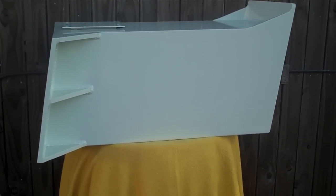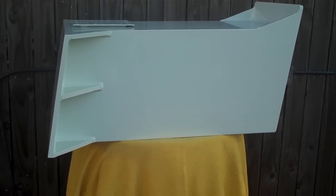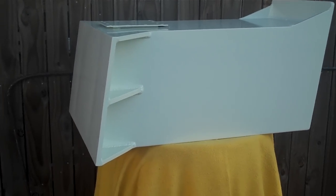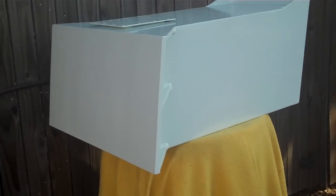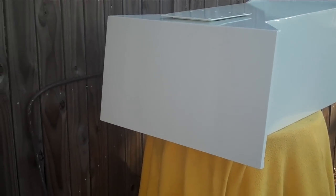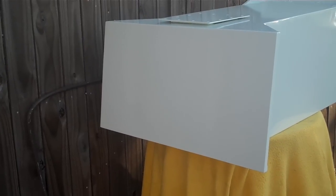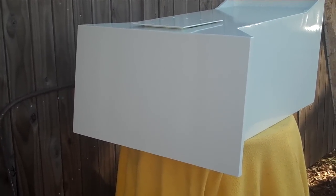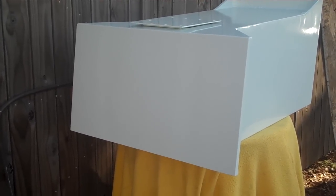A lot of you are converting houseboats and speedboats and runabouts and so forth to a single engine inboard-outboard conversion. And this is ideal for that because once you block up your hole and fiberglass your hole in, this flange is wide enough to go completely over the hole so that you don't have to put any stress in immediately at the hole location.